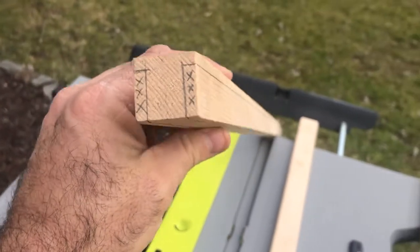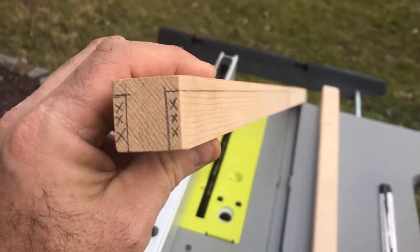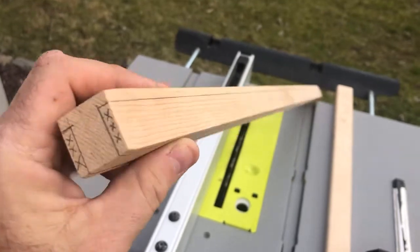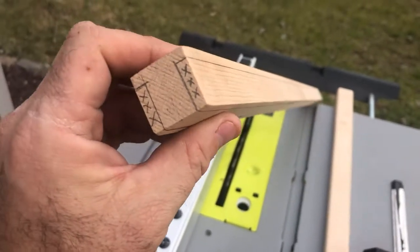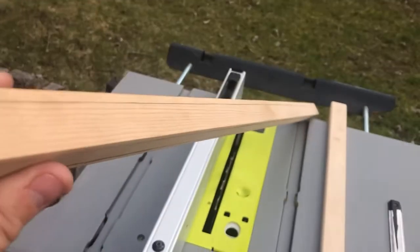You can see I've drawn out my lines on the piece of wood. This is the vertical where the hinges get attached to the back of the vertical stab. So we're going to rabbet each side of this down the length of it.